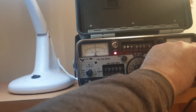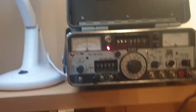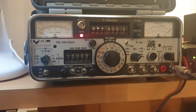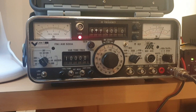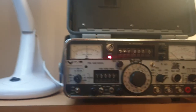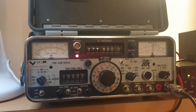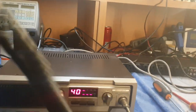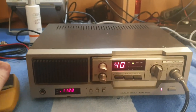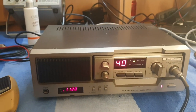Even though we've got four watts of power, what I want to look at is the deviation — I think it's going to be fairly right. Counting one through five, just like we like to see, sort of four to five kilohertz of deviation. Back to power — beautiful, that's actually good. Always give the mic cords on electrophones a bit of a rattle, just to make sure they don't have intermittence in them.